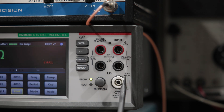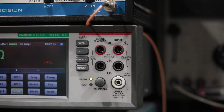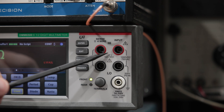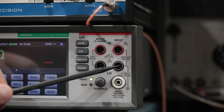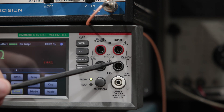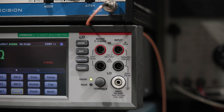The scope is ground-referenced — this doesn't exist. So what a lot of people think is the low terminal, the ground lead, is actually ground. There's no float here. Because it's a low-impedance ground connection, if you hook something up that's ground-referenced to, say, a negative supply, you'll actually short the supply out to ground, and that's what causes the damage. On a DMM, we actually have differential measurements, so it's measuring between the two terminals and doesn't care about anything else. I could measure a 50-volt and a 120-volt supply together — it'll tell me there's 170 volts between those two terminals. So you can poke around a circuit a lot more freely with a meter than you can with a scope.